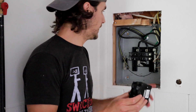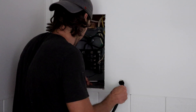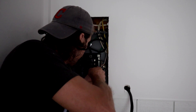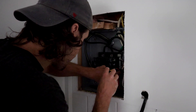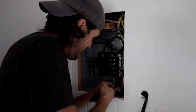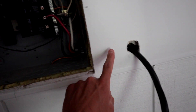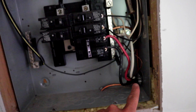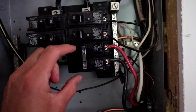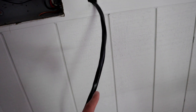The breaker goes in the box. To summarize what I just did: I ran this wire through the wall, through the electrical box, secured it in place to the box, ran the hot wires — the red and the black — to this new 50 amp breaker that I installed. And then to the neutral bar in the back, I added the white neutral wire and the copper ground wire. Now that that part's done, I need to put all of this wire into conduit and then mount the new outlet.